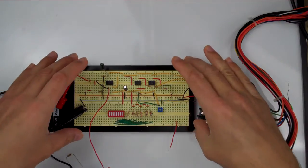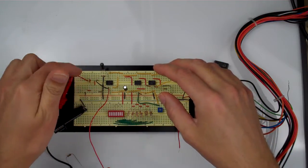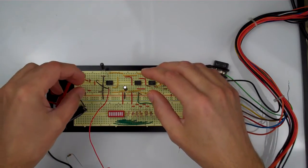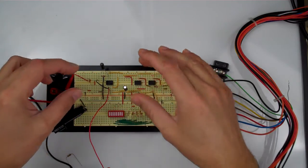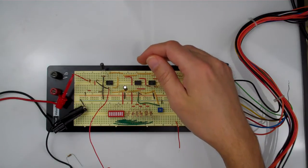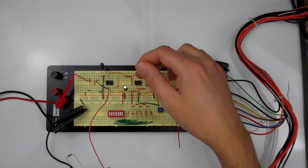I've taken the digital storage oscilloscope circuit here and changed it around quite a bit in an attempt to get this first section to work. I've drastically reduced some of the complexity, taken the switch out, trying to remove as many non-essential components as possible to eliminate any problems and see where the errors were coming from. One of the things I noticed was that the power supply lines were a big contributor to the noise coming into the circuit.